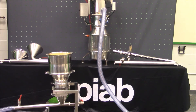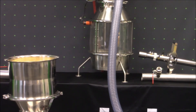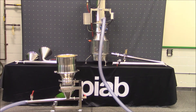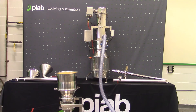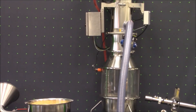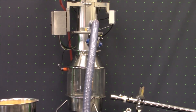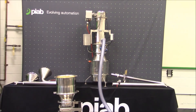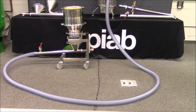The clear collection pot below the PIAB has a high level sensor to stop the PIAB when the product level has reached a high point. This prevents the conveyor from overfilling the receiver vessel and saves on air consumption since we are only moving product when the vessel below the conveyor has a need for material. The sequencing of the PIAB is managed by one of PIAB's control boxes, which you can see mounted to the left of the conveyor. On the right is the valve box which communicates with the PIAB control and starts and stops the PIAB based on a high level. Our control units can be completely pneumatic or run by a PLC main operating system, and we also have electrical control units which have a host of special features.